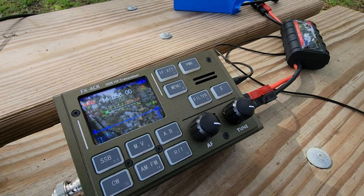Also listen to the times that I'm calling CQ when that's not happening, and you'll hear the other issue — the issue of audio artifacts. It just sounds like a scratchy speaker. That's not what it is, because I only get that when I'm transmitting CW, not when I'm receiving or moving the radio around or anything. So it's not a loose connection inside the radio, even though that's what it sounds like.